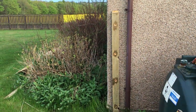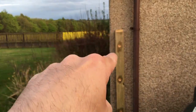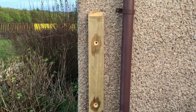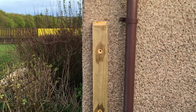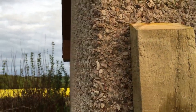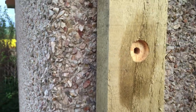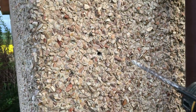So that's the post ready — four holes with recesses and the angled top. The first thing to do is set the height, hold it in position, and drill the first hole. We'll use an 8-millimeter SDS masonry drill bit, though a normal drill with hammer action and masonry bit works too. Set the height to roughly where you want the post, then just give it a quick pulse to mark the concrete, take the wood away, and you can see where it's marked. Now drill that hole fully.